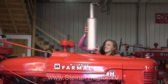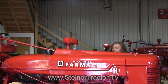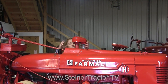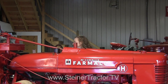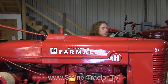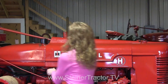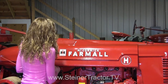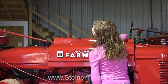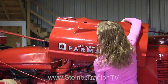So let's get started. First, taking the muffler off and setting it down. There's the muffler clamp, then we get this breather cap off the top. There are clips on this hood — I already have them pulled out on both sides. The hood is loose, so now I'm going to lift it off.